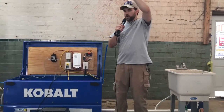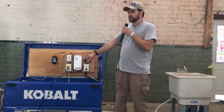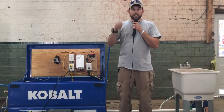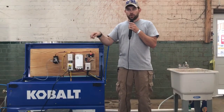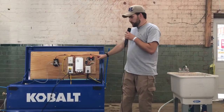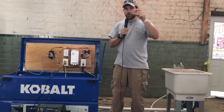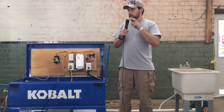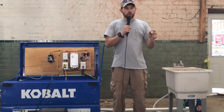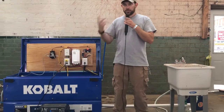So that house right there, when it rolls out, it's got everything, all the new works, bells and whistles in it, with the exception of this new monstrous pump, because she doesn't need that because all her water is, like at my house, at point of use. The other side of the wall is her water, so she doesn't need a monstrous pump to pump it in. The filtration on it, John has got us some new filters coming that are even smaller micron. The only thing about this is it's a two-edged sword. It's going to filter your water heavily, but also you're going to have to change filters a lot more often because it's going to get a lot more particulate out of your water.